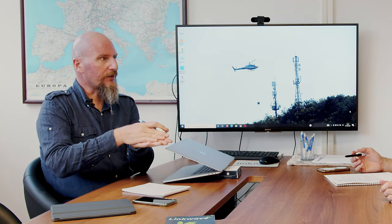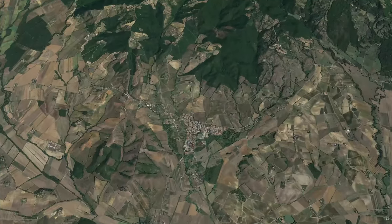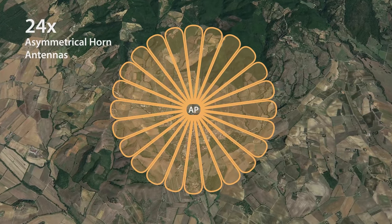Your horns give us 15 degrees, have a good gain of 20.5 dB, and a good elevation aperture of 22 degrees at minus 3 dB, so I am able to cover more people than a standard sector that has only 8 degrees of vertical aperture. The 15-degree width and 22-degree height is perfect to cover people under the tower and in front of the tower. And the polar diagram — the diagram is just one main lobe alone. It's perfect.